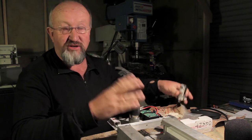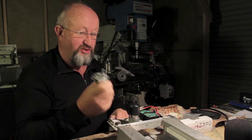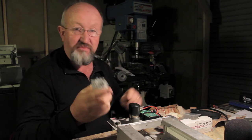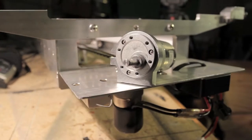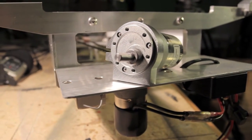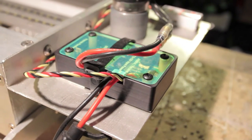And as this motor is not really powerful enough, it'll go to about 45 degrees, but it won't go the full way. I'm going to put two of these bigger motors and attach them to the ends with this simple bracket. Because they're off-centre, I can tighten the cable by simply turning them around till I take up the slack on the cable.